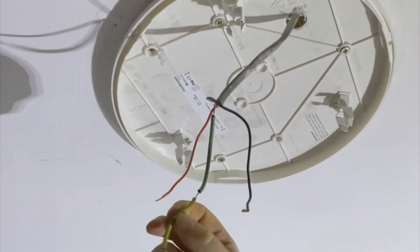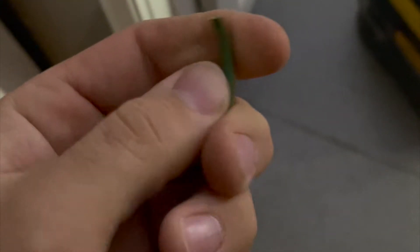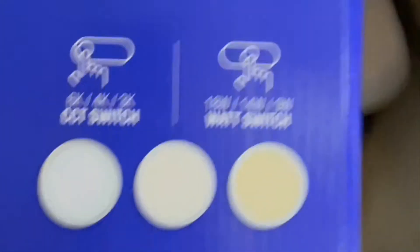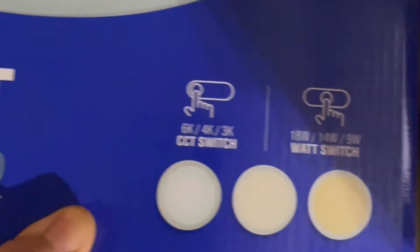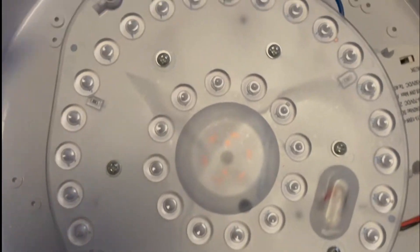Swapping it out, but the earth sleeving is really brittle — it's got very hot in there. We'll show you what we're replacing it with: the new Saxby's Lighting Heroes. They're really cool because they come with a selectable brightness switch — you can go between 18W, 14W, and 9W — and also a colour temperature switch, which is really cool. So if you need to match up to existing lights like we have here, you don't have to get the exact same one. They've also got a quick-release mechanism so when fitting the light you can hold it up, do your connections, and then quickly pop it back together.